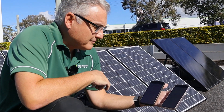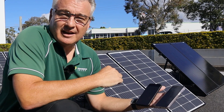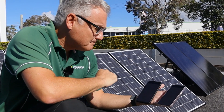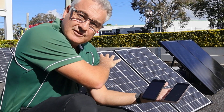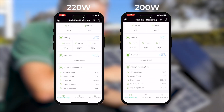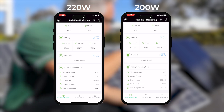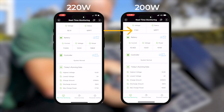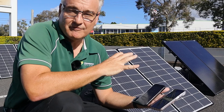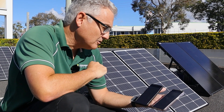The solar panels have been going since about 10 o'clock this morning. The day isn't fantastic — it's late May, getting into winter, been a patchy cloudy day — so it hasn't been spectacular, but it's not raining. Looking at our new lightweight 220 Alvolta kit compared to our tried and tested 200, the voltage the 220 is putting out is sitting at 19.1 volts, compared to a normal 12 volt solar panel which is about 17.8 volts, and that's what our 200 is doing. High voltage is fantastic — it makes everything work more efficiently, and that really high voltage is excellent from the new Alvolta 220.